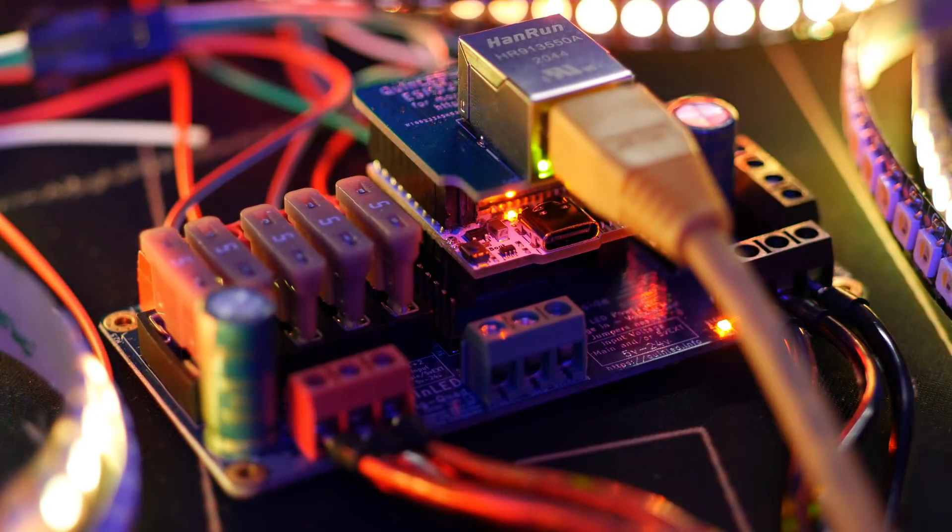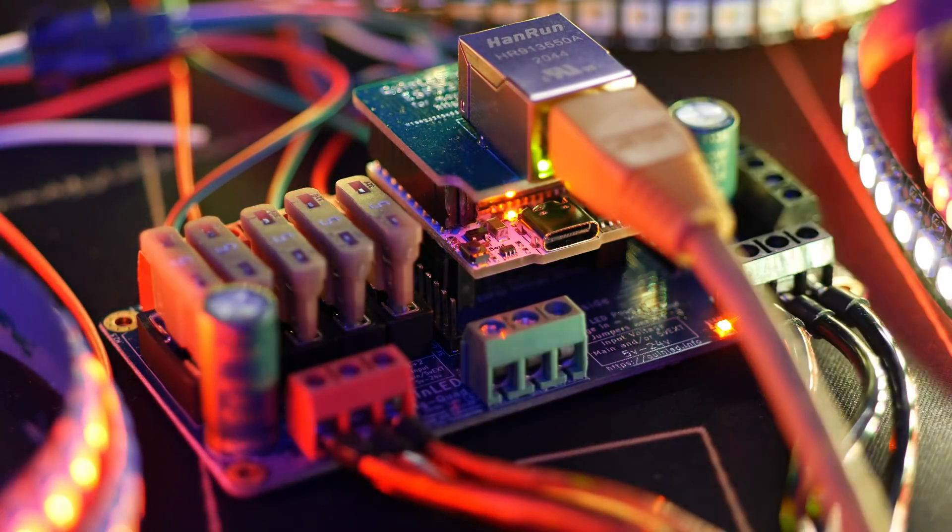There are a whole lot of other small changes and tweaks, but I won't bore you with those. Just know the boards are better than ever. The features that make them popular — such as having 5V and 3.3V pins together with several GPIO pins available to hook up sensors, buttons, analog or digital microphones, or whatever else — are still available, and with these new version boards will even work in conjunction with the Ethernet version of the QuinLED ESP32.